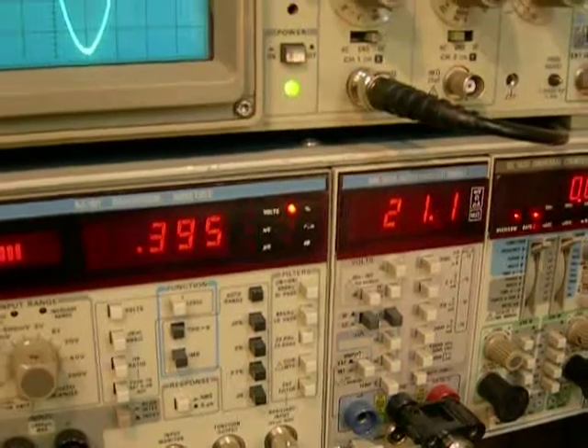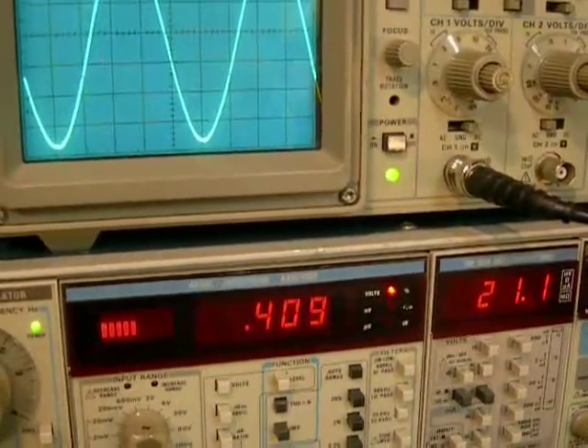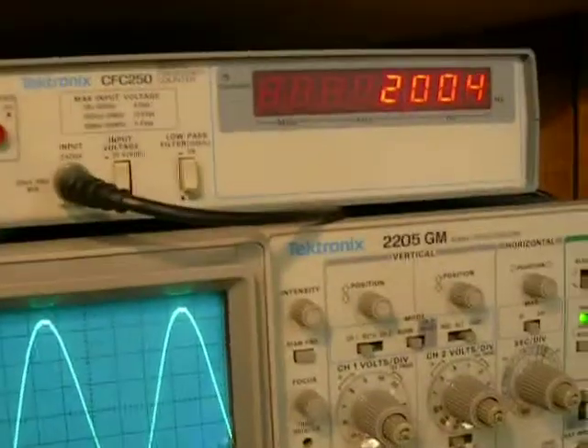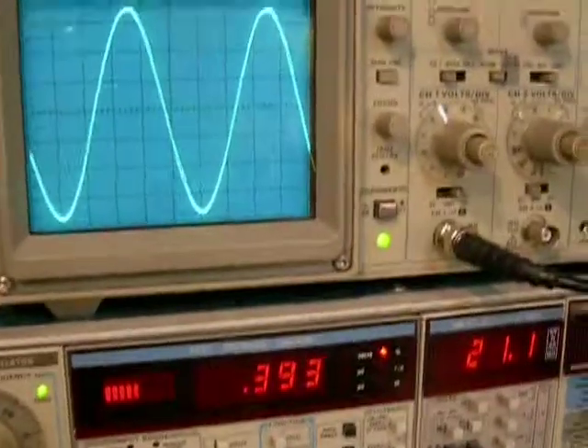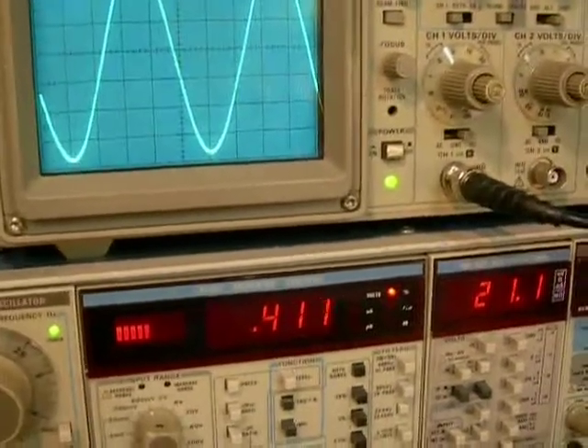21.2 — that's not bad, that's a bit of power. That's nice and steady: 0.4%, 21.1 volts, 2 kilohertz. 21.1 squared divided by 8 is our power in RMS watts.